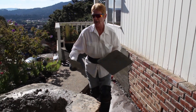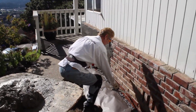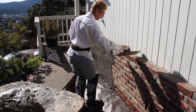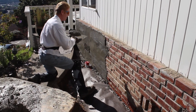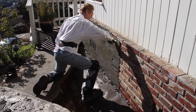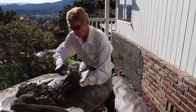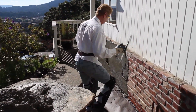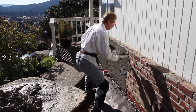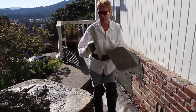What I'm doing here is covering up some brick. We only have to go to here but we're taking it down further because they're covering all this stuff up. We don't have to do the cut tops because they've got a cap for this. What I tell folks if you're going to go over brick is: put it on thick enough where you're just skim coating. A lot of guys say 'I'm gonna scratch and brown over brick,' but you don't need a scratch coat and a brown coat.